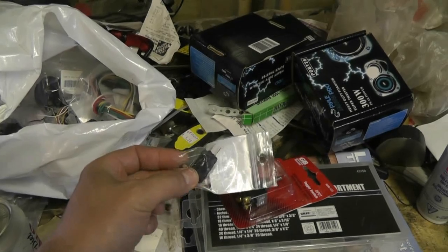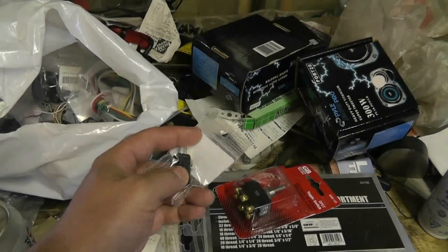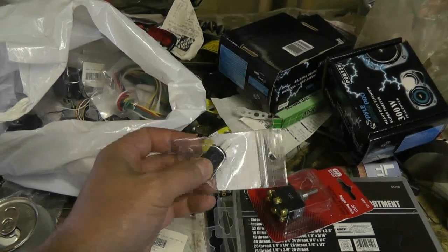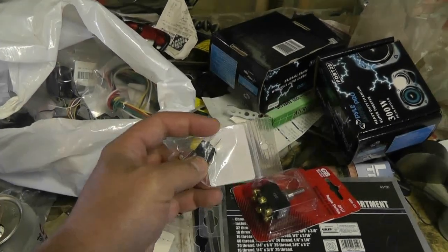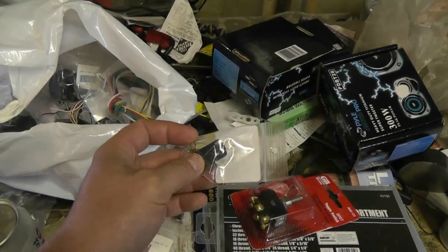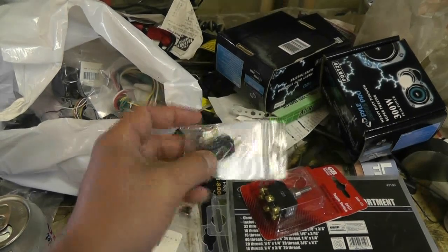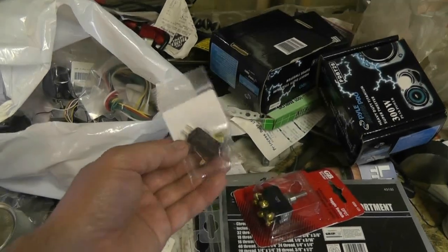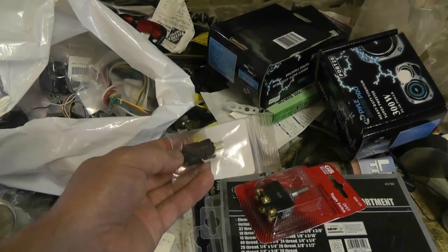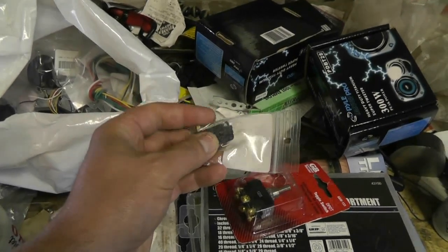Since that truck didn't have a parking brake, this should be an easy thing to wire in — just ground one end of it and ground the normally closed end, then put the wiper on the input to the e-brake light on the truck. I could probably use a smaller one; it did have some smaller ones, but this will work quite well. It probably looks familiar if you've ever cracked open a pinball machine — a lot of very similar switches in that, usually with a longer wiper arm though.